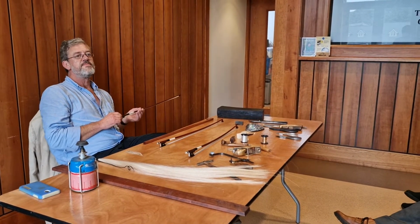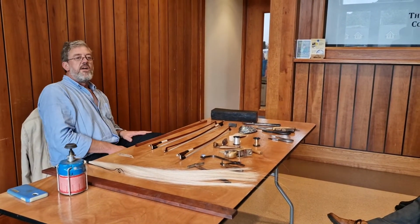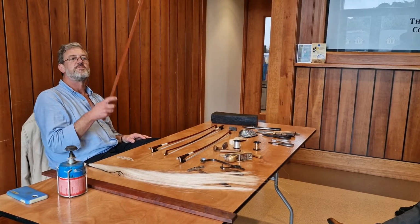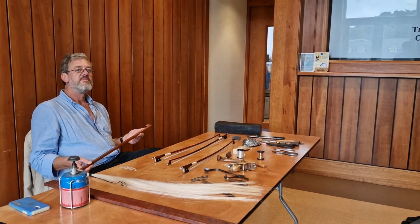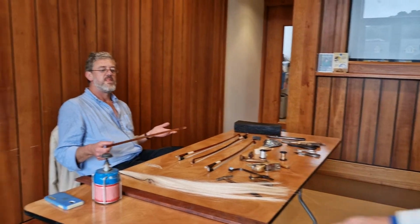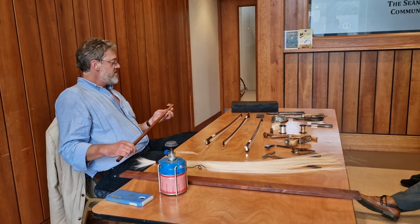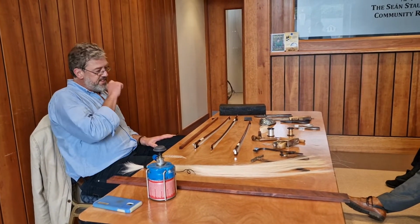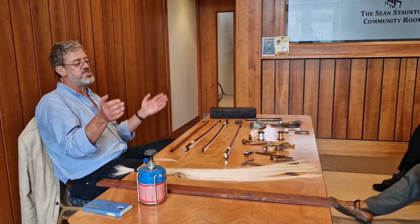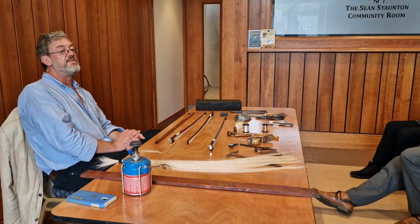Gary, how do you manage wastage? If you take the piece that you have in front of you, with the little L end, and that's all one piece of wood. Right. So are different bows of different lengths? In other words, that you don't end up, I mean, you cannot get very many of those out of this because you're going to have a lot of wastage unless you are able to make bows of different lengths. The violin bows and viola bows are the same length, 730 mil, and then a cello bow is bigger in every way but shorter. A violin bow and a viola bow are 730 mil, a cello bow is 700 mil.